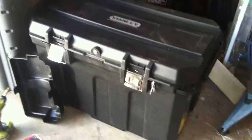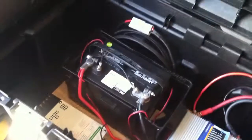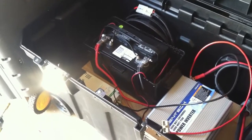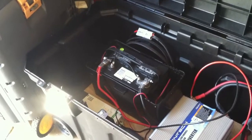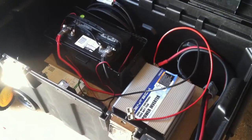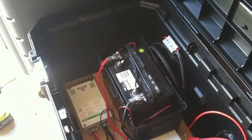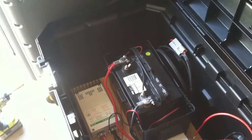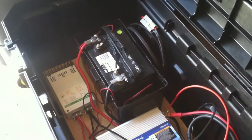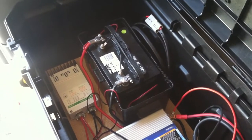There's a lot of wisdom in making your stuff semi-portable, even though it's obviously not something you just throw in the trunk of a car or wear in a backpack. The idea is you could evacuate if you need to. This has wheels and an expanding handle. The batteries we're using are not the type you store sideways or upside down long-term, but tilting when loading into a truck isn't a major issue. The components inside include a 3000-watt inverter and a 12-volt RV marine combination cycle battery, which is made to push starting amps for getting electric motors going. I've got a relatively short cable run between the battery and inverter.